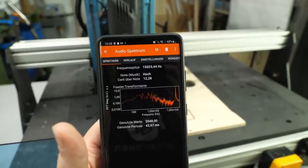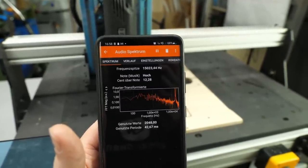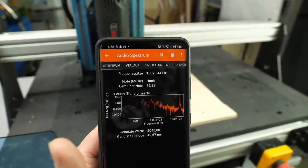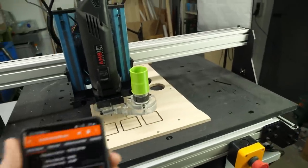Just a quick note: the stepper motors are powered by default and have a really whiny high-pitched sound even at idle, which drove me crazy. While you set up a job you can disable them, but that will lose your homing position and squaring procedure.